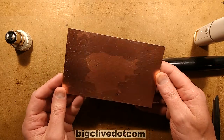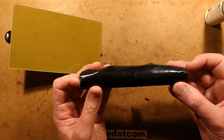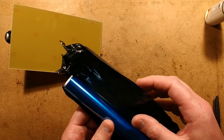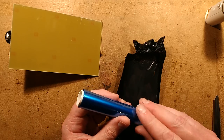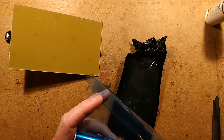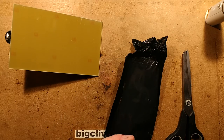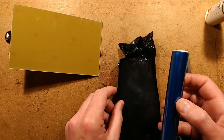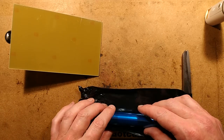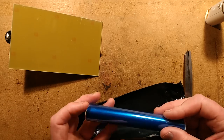I've got my freshly cleaned and still wet copper clad board and I'm about to make it light sensitive — leaving it face down at the moment just so dust doesn't land on it. I've got my light sensitive film — dry film photo resist, readily available on eBay — and for those of you who have seen me do this before, feel free to skip forward. One interesting improvement: this is the first time it's been supplied rolled around a plastic core, which means it arrived without being all creased and folded. You can still use creased material — it just makes it look a bit messier — but it still works quite well.